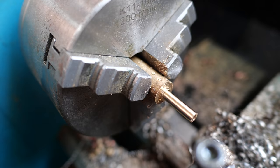Once the bushing was fitted, I needed to widen the existing hole on the yoke in order to accommodate it. This was a weird shape to clamp, and I'm sure me doing this will tickle the jimmies of all engineers watching this, but I found the easiest way to ensure I lined up everything accurately was to simply skewer the yoke on the drill bit while it was in the milling machine, then use this to locate the vice jaws below. This was then drilled to a few hundredths of a millimetre wider than the bushing, and then we attempted to get it fitted.